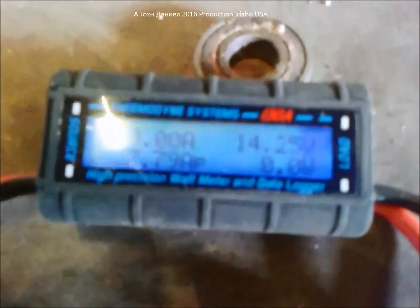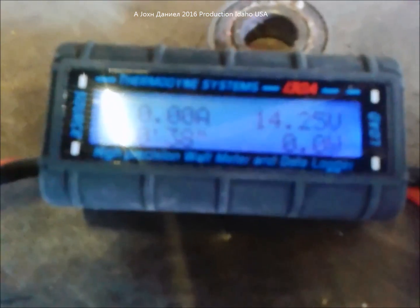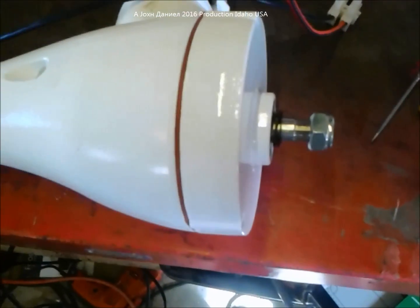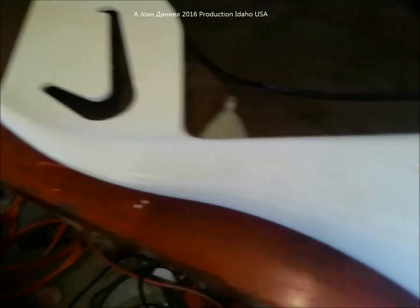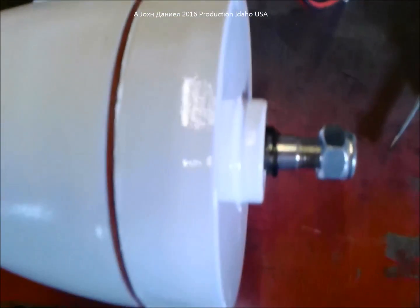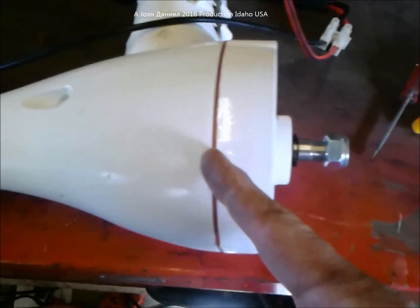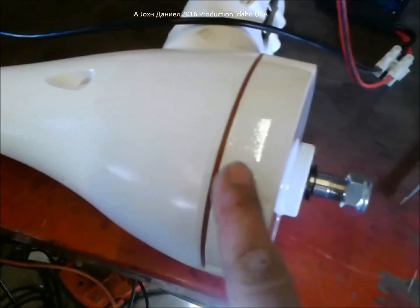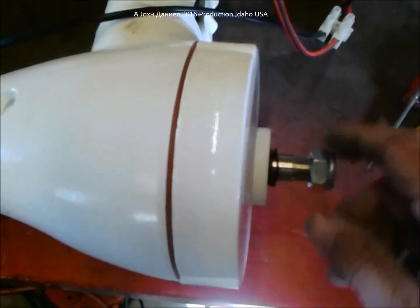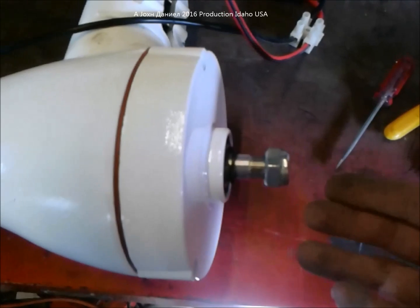Under load it slowed down to probably about 350 RPMs, so that's not bad. This little generator is appearing to be as advertised so far — we're talking about function, not durability. It turns easy, so anybody who buys a generator and it comes with a little five-foot set of blades or even a seven-foot set of blades and they're claiming anything over six or eight hundred watts —